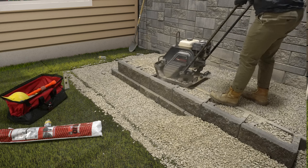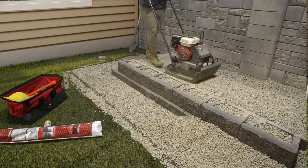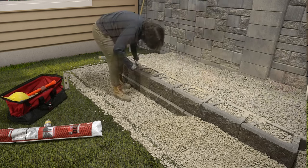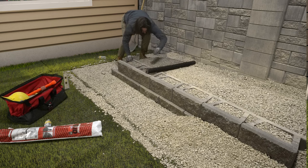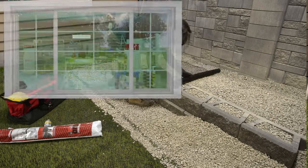If another step up is needed, run a mechanical plate compactor over the location where this step up will be, over the top of the blocks where there are two or more courses, and behind the block where there is only one course. Make a minimum of two passes. Continue this process as you prepare your base course for your wall. If geogrid reinforcement will be needed as part of the wall, refer to your approved plans for the course locations and position.